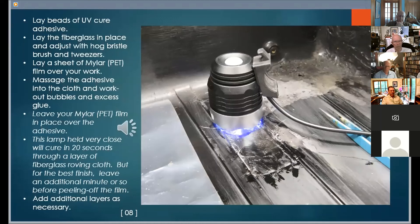You will have an almost transparent patch. Here I elected to apply a thin sheet of fiberglass cloth first — it simply makes it easier to see that I have brought the cloth into the closest possible contact with the cracks. I can then immediately proceed to lay down more beads of adhesive onto which I can lay a second sheet of the heavier weight roving cloth. After you are finished applying whatever reinforcements are necessary, apply a coat of flat colored spray paint to match your cabinet.